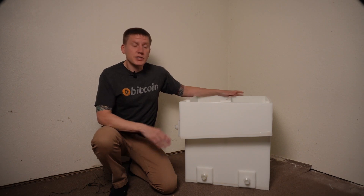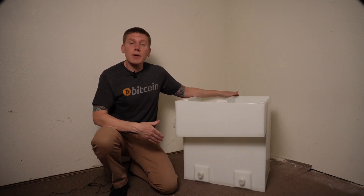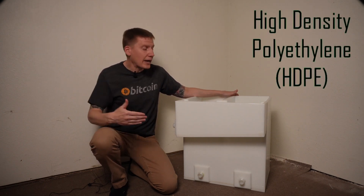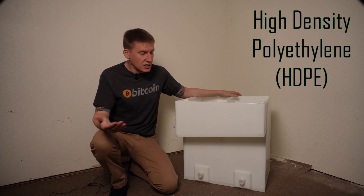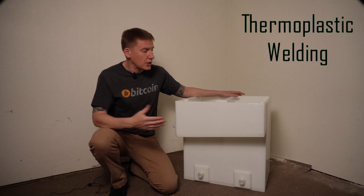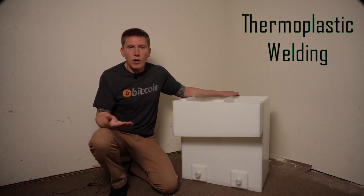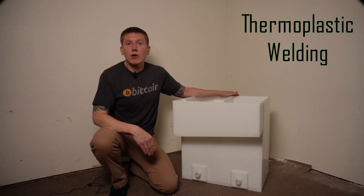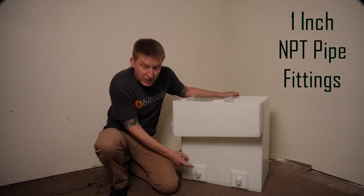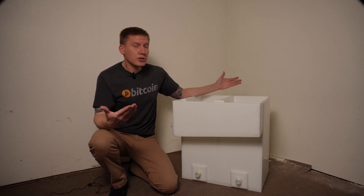Here is my tank. As you can see, it's fully built and ready to go. The material chosen by the plastic shop was high-density polyethylene. They chose it from the materials compatibility list because it's pretty cheap and they had it in stock. One of the big things for them was that they decided to do plastic welding instead of solvent welding, figuring it would be a better design overall. They also found fittings made out of the same material that they could weld in place, which makes for a really good interface when connecting lines.